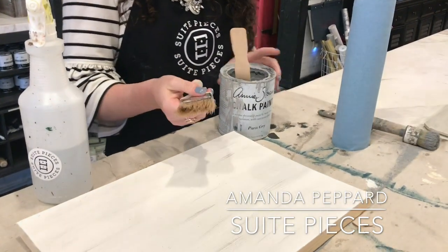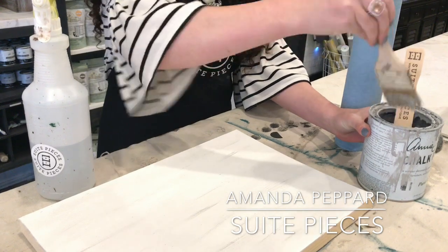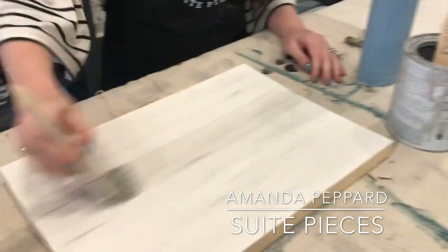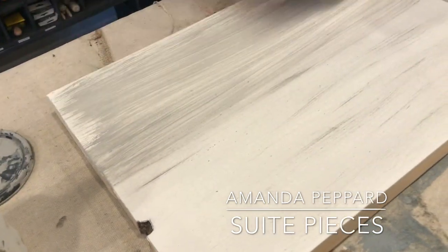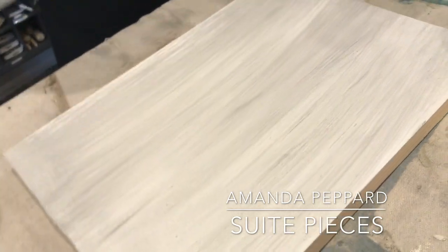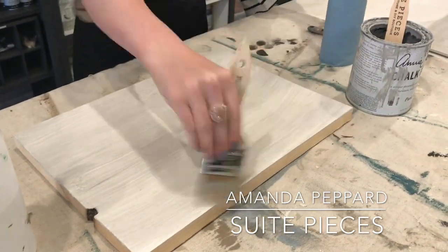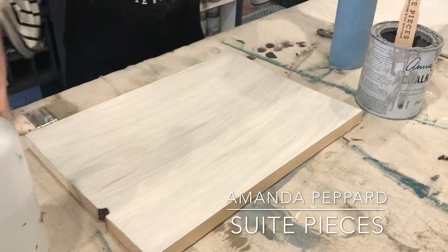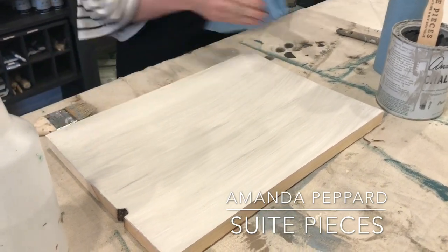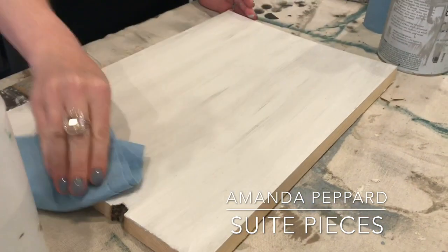This is a color wash — I'm using the same Paris gray paint. I switched to a two-inch chip brush, available on our website, which is great for this technique. I put a tiny bit of paint on the brush, then I spritz the surface with a little water, and brush the paint into the wet surface to spread it out. I might add a little more water because it's sticking a bit — my paint isn't sliding around nicely. I have more videos on our YouTube channel going into washes in more depth.